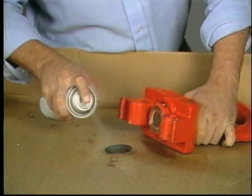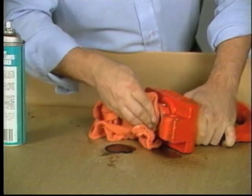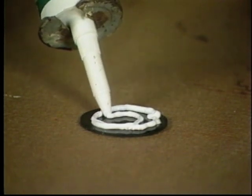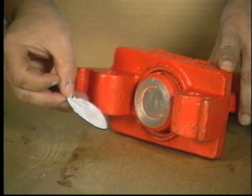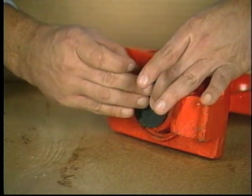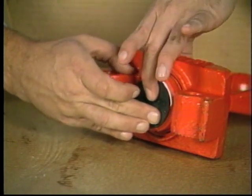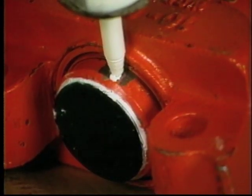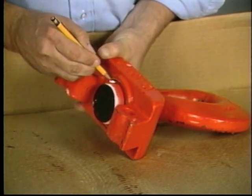Clean the top surface of the nut hook shank, the end of the spring pin, and one side of the rubber cap with a degreasing solvent. Then apply a silicone rubber sealant to this clean side of the rubber cap, covering the entire surface with about a 1/16-inch thickness of sealant. Once the sealant has been applied, place the rubber cap on the top surface of the nut hook shank, pressing it downward so the sealant flows inward and outward from the rubber cap's edges. Wipe away the excess sealant. Finally, apply the silicone rubber sealant to the ends of the spring pin. Also, check that bearing seals, where used, are firmly in place and in good working condition.